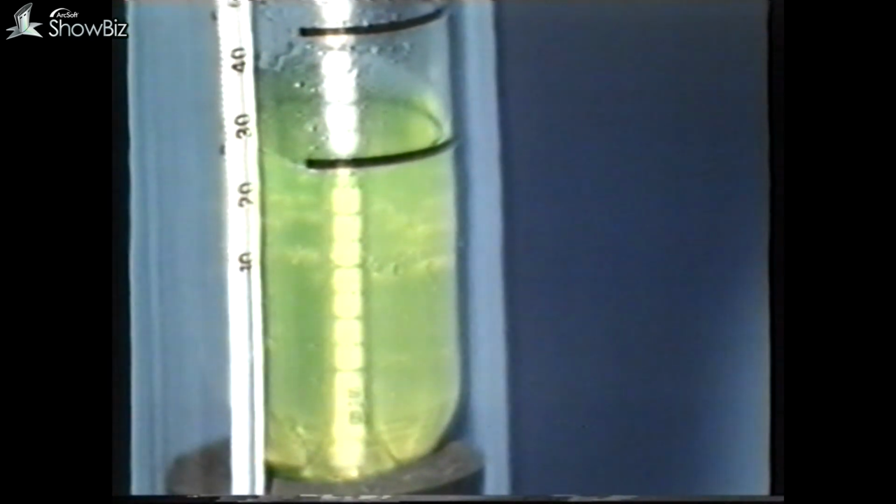With the cooling system, it's important to check the antifreeze concentration, which should be between 40 and 60%, which gives adequate frost protection and, in addition, provides protection against corrosion within the water system. With regard to the latter, this level of concentration must be maintained all the year round to protect the engine against corrosion.